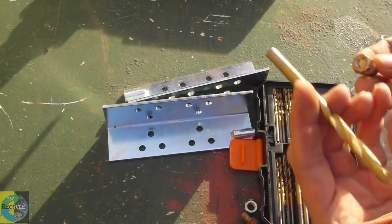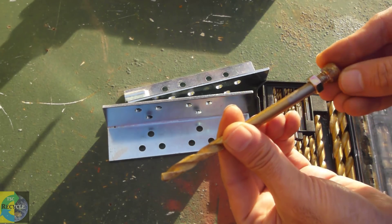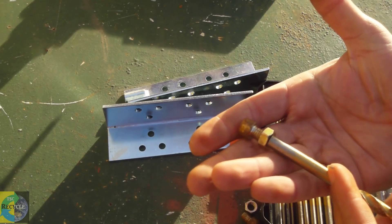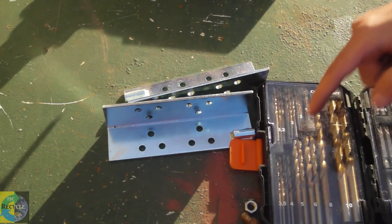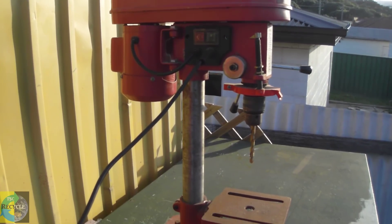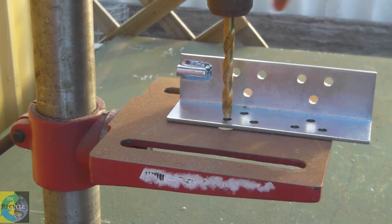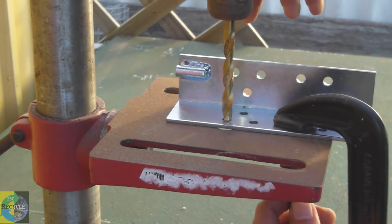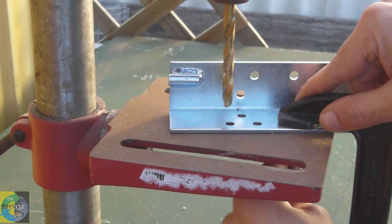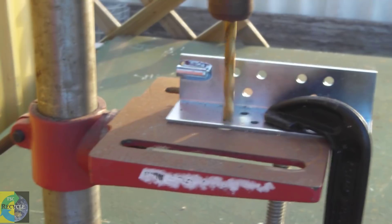Once that's off, we look for a drill bit the same size as the bolts. It's better if the drill bit is the same size because that will prevent any movement in the brackets. A drill press will come in very handy — makes the job much easier. And always remember to clamp down your project to prevent it from spinning out of control and creating some damage.